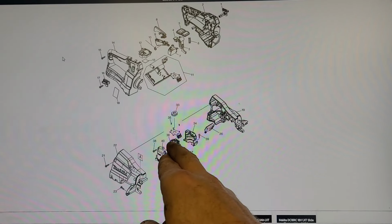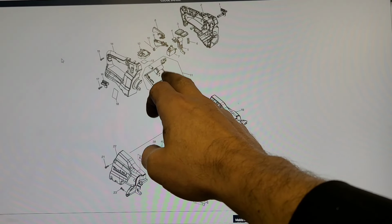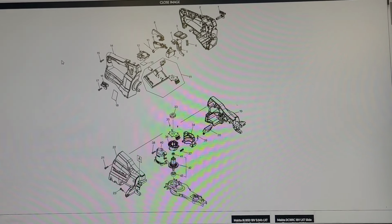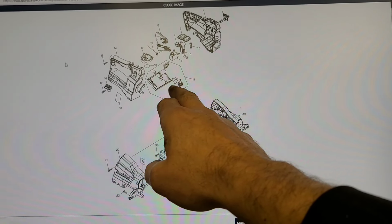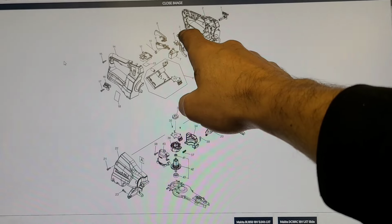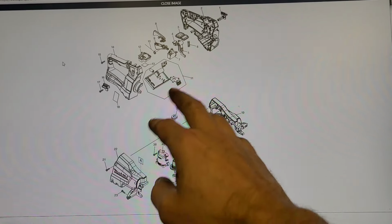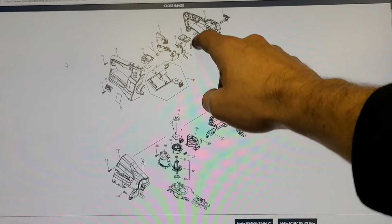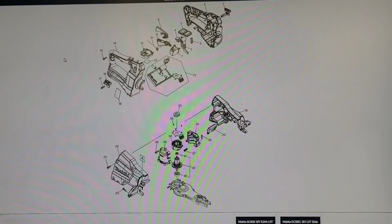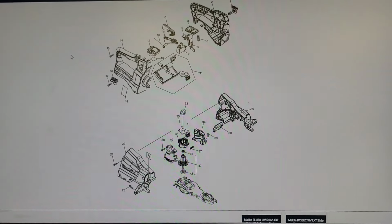You'll also check the field, because that is actually sold separately. So if your controller is okay and your field is burnt out, you can still replace this on its own. That's a lot cheaper. This might be expensive, but it'd be more expensive if the other parts weren't separate. The two switches and the wee control board and the stator, if they were all together, this would be way more expensive, but you can actually buy them separately. There are your switches, and that's your wee on-off power button up in here, battery retainer. Everything else is actually separate on it. But that, of course, is expensive, but...